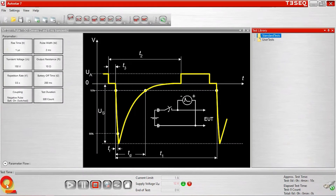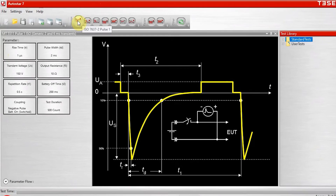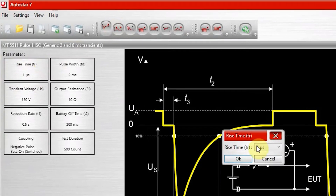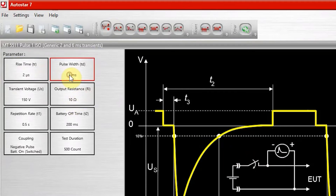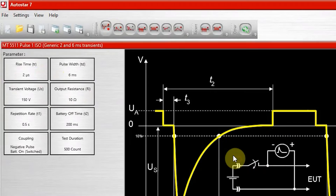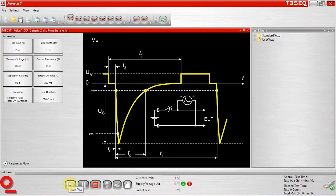There are a couple of different areas of this software to talk about. The first is the common pulses at the top — these are your ISO 7637-2 pulses, all the way from pulse 1 to pulse 5, which includes your clipped load dump as well as your load dump. Looking at the parameters on the left side, you can modify the different parameters by clicking on them. For example, you can modify that to 2 microseconds and 6 milliseconds for the pulse width. When you're ready to begin testing, hit the start test button — the play button — and you also have pause and stop controls.